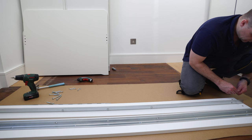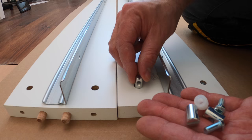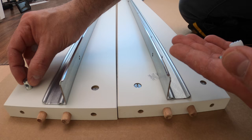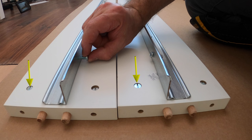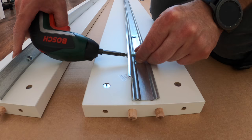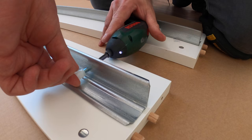Exactly the same on the other side — we're gonna have those four nuts and those stoppers. Place the nuts first in the holes; the line should be lining up with the front hole on each nut. Some of the nuts may need to be pushed slightly in. Here the stoppers are exactly the same as on the other side — screw with plastic on top — that's the stopper for the bed slats.